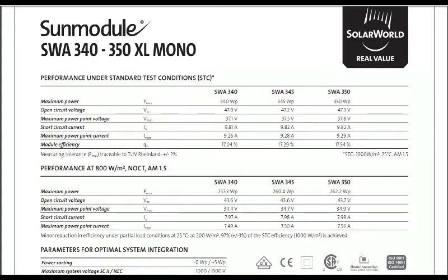That's how you figure your charge controller, but you need to know these numbers before you go look at a charge controller. The Outback charge controllers are the other ones I recommend — I've used them and they're fantastic, though a little more pricey than the Morningstar. If you're building a 48-volt system and trying to get the maximum number of panels on a charge controller, Outback makes a controller that still maxes out at 150 volts but accepts up to 60 amps, so you can put considerably more panels on it.